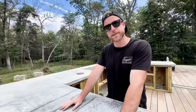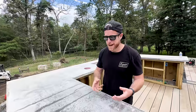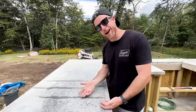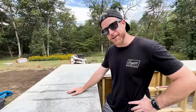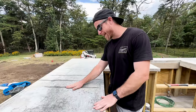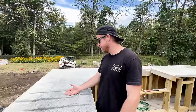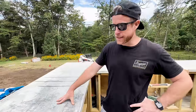We've got a big problem on our hands. The concrete did not cure properly. I think it was too hot and it cured too fast, which led to some shrinkage — and shrinkage is never good, especially with concrete. We have some cracks that have developed. Tried to grind some out yesterday; some were very superficial and came out, but some are more substantial. It doesn't look great, we can't keep it like this. What we're going to do is a porcelain overlay on this.